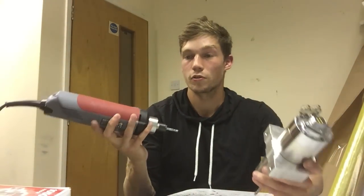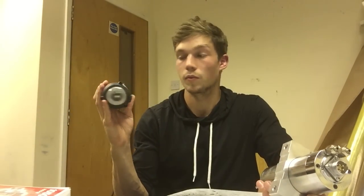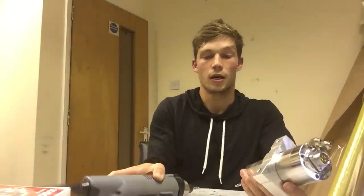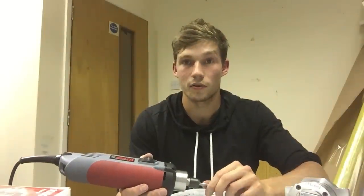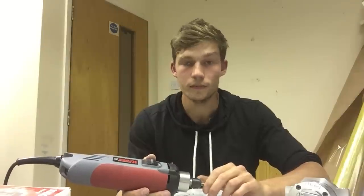Hi there, I'm Matt and this is my user review of the Kress FME1 — the 1050 watt version — versus the typical Chinese spindle you can buy on Amazon or eBay. If you're looking for the quick answer, I would choose the Kress spindle all day long, just because it's lighter so you can change direction on it much faster if you're using a CNC router and wanting to improve performance and speed. And it's much quieter, so if you're sitting in another room you can't hear that piercing kind of sound that the Chinese spindle gives off.